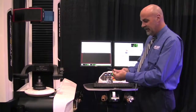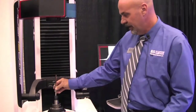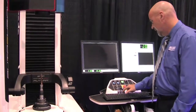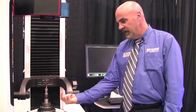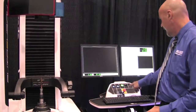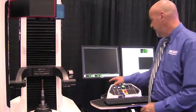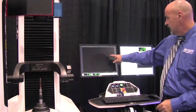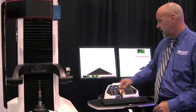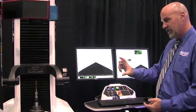Once it's measured that, I'll take the cutter into a setup bushing and introduce it into the holder. I initialize it — there's a CNC pin underneath the holder that's going to come up to help measure that cutter. The camera finds the top of the cutter, and as soon as it sees it, it's waiting for the pin to move the cutter. Once that happens, it measures between them so it knows the length of the cutter.